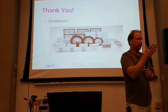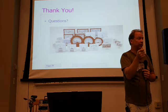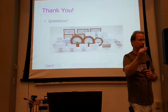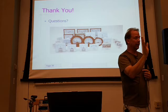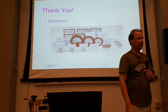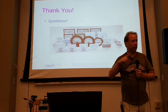A lot of those meters will have different functions depending on what you're testing on the tube tester. So some of those other scales might be counting on what that coil resistance is. If one of those scales is measuring voltage, for example, then the current that flows there matters. If that's all it is, then you're okay. Even if you're off by a bit, the internal resistance is quite high, about 1,900. Like this meter movement here, that's got about a 4,000 ohm coil resistance.